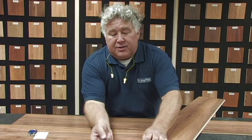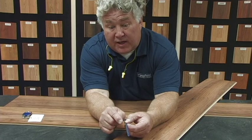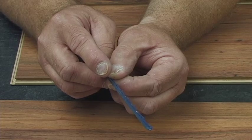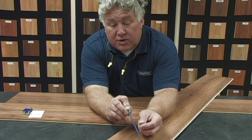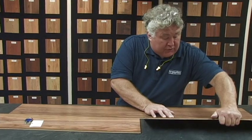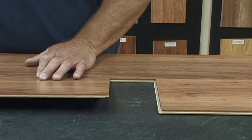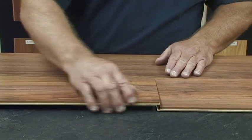When you take it out, you'll notice there's a bevel and it has to be reoriented correctly. Another clue that we give is we stamp circles on the top side of this tongue — the circles always go up towards the decor face. Always from right to left to leave that exposed for us. Then the piece comes in and overlaps it and actively locks into place.